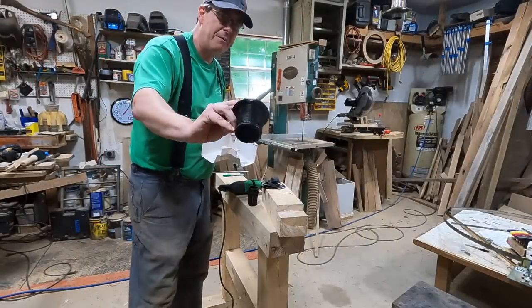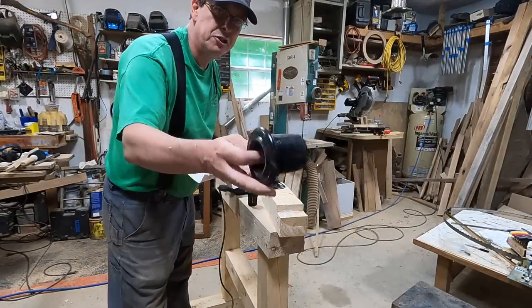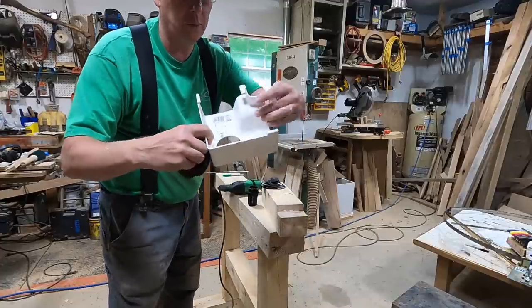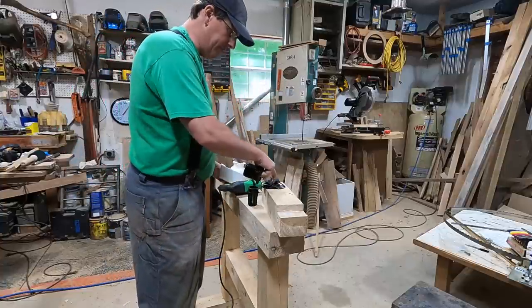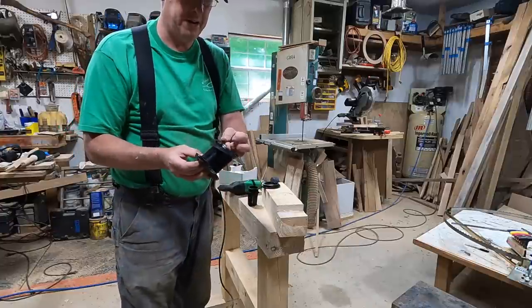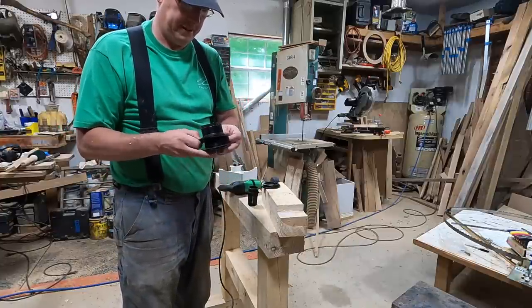Yeah, I had to do a slight modification to the bulkhead. I had to do the same thing on the mobile coop. So just cut a little notch out of it there, so the little rib of the turn here doesn't foul. I made sure obviously not to cut the gasket, and I didn't notch in too far that it fouls the gasket from doing what it needs to do. So left enough of the lip there.